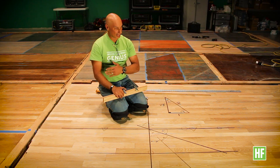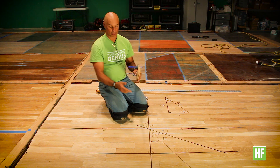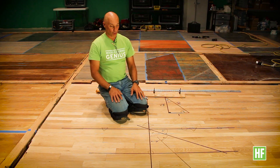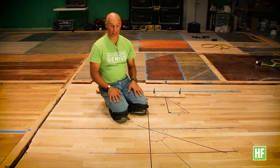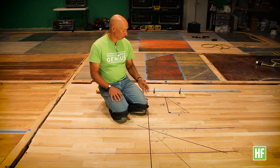As far as what I did here with Magic Marker, this can be extended to any distance you can carry a straight line with. As long as you have a very stiff piece of material to mount your trammel points to, you can have this at 1 foot, 10 feet, or 20 feet long and mark and snap lines straight. Anything I did with a Magic Marker can easily be done with chalk lines — again, the finer the line, the more accurate your angles will be. I have used trammel points for job layouts, for wraparounds — connecting a parallel line in one room to the opposite room through two doorways — to create compasses and medallions in my own shop. It's a challenge and something very satisfying when you can complete your own medallion instead of buying something off the shelf, using scrap pieces of wood from job sites to create beautiful artwork with almost nothing other than your imagination and some simple trammel point techniques.